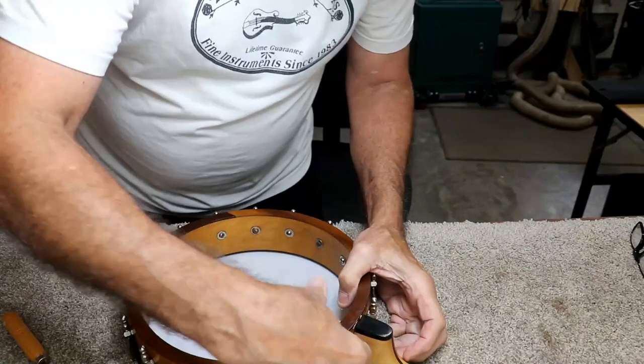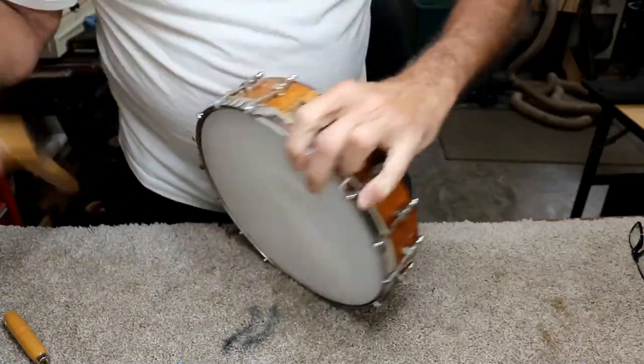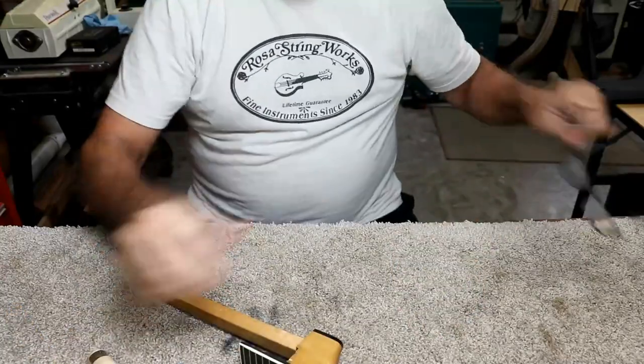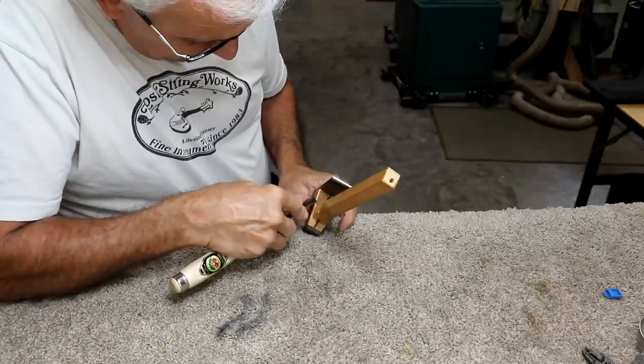It's proud of touching this surface here and it needs to touch that surface. So I'm going to have to find a way to get that knocked out of there. I don't know if these chisels are sharp enough to cut that end grain on this old maple, but let's see if I can find a way to get in here and cut this out a little bit.